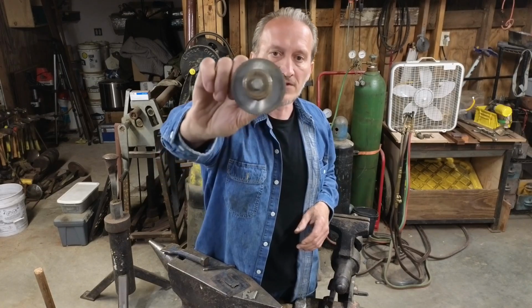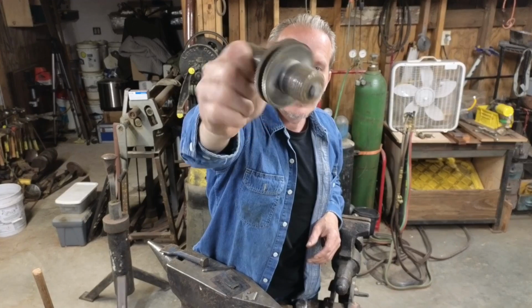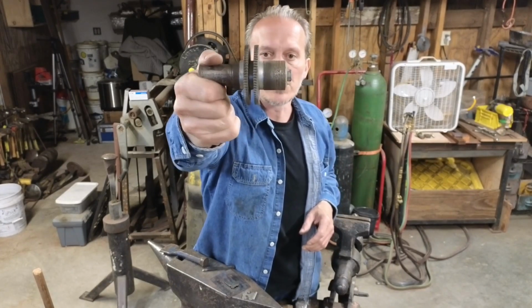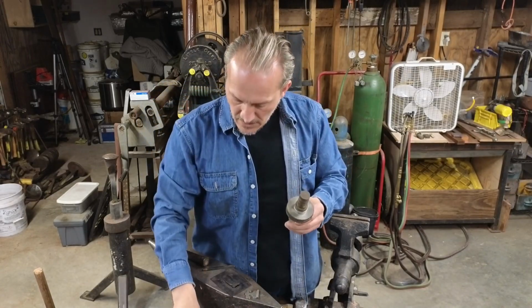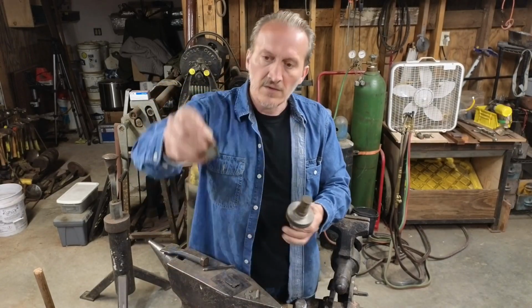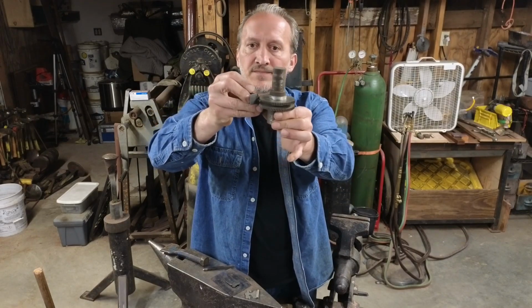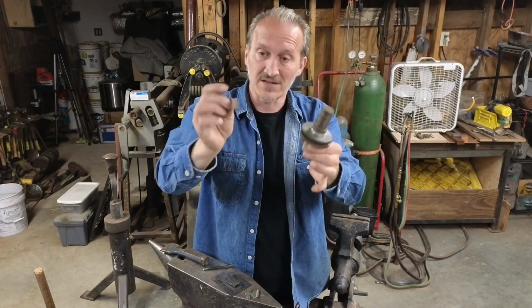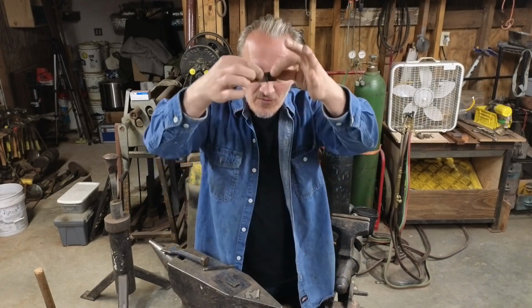I bought the blades. I set up the spacing on these, and this will go in my milling machine. So I can set up my milling machine. It's really kind of handy. It'll actually cut the knuckles for you right there, nice and clean. So you just figure out your spacing based on your knuckles. Swipe right through it, nice and easy. They move well.